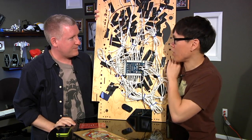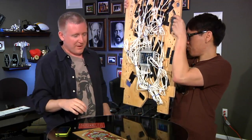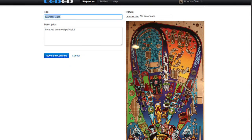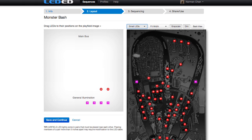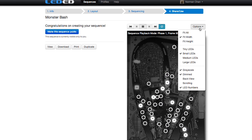There's a website for programming these sequences because you can't download it from the pinball machine — you have to mimic that animation. The Arduino is not powerful enough to actually emulate the old pinball ROMs, and interpreting that ROM data for matrix light hardware is really hard. So we just made our own from scratch. You take a picture of the play field, upload it to the web tool, and it simulates the back of the play field — flips it around for you. You drag your lights on to wherever you placed them, click them on and off, and you can create a light sequence in about 20 minutes. Even if you don't own a physical play field, you can experiment on the site and just animate and have fun.